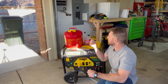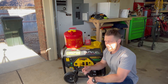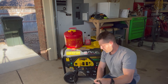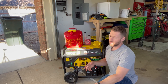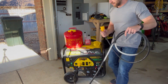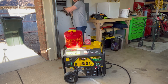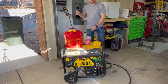It works in the same capacity to provide power to your home. I have that transfer box with all the power running through it that I want — my garage so I can open a garage door in a storm, my internet, TV, the most important things, heating, air conditioning, kitchen, bedroom, bathroom — it's all on there. I just take this, leave it in the shed in the backyard. When the power goes out, I pull it out, fire it up, take this right here, plug it in, and just come over here. It's keyed so it can only go in one way. Plug it in, twist it, turn it on, and start flicking everything from line to generated power.